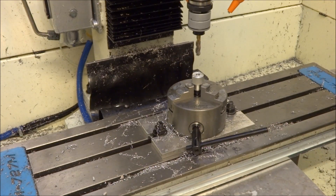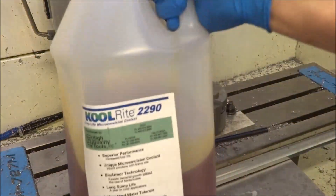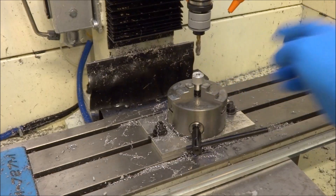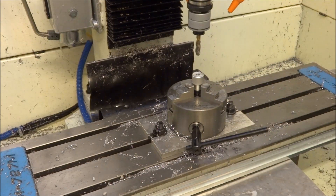It's running really well. I switched over to the Cool Right 2290 and I can tell the difference right away — the tap comes out clean. This is a lot slicker coolant than the cool mist was. I haven't done any machining, but for tapping it's real nice. Before I was having to hit the tap with some tapping fluid, but with this Cool Right I don't have to do anything.